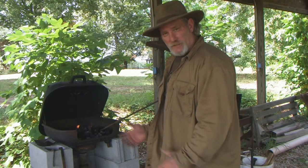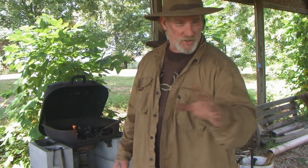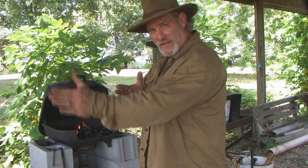So I got a piece of metal that's a little bit short here, and I need it to be about as long as the other two to form that tripod. I've got just the right amount of everything I want, so I'm going to try to pull this thing out a little bit and extend it by drawing it out where I'm going to make my eye.